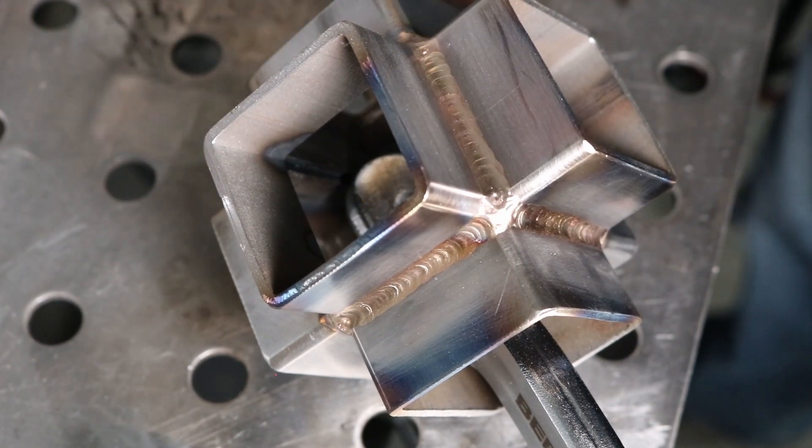Now let's go ahead and go back to the pulse settings. Here you can see it takes a few pulses to get things warmed up and melted. With this it's a similar technique — I'm just advancing forward in between each pulse, and then as it pulses, the puddle will grow out forward and I retract back a little and add that rod right into that puddle. The key is you're not trying to melt the base metal; you're just trying to heat it up, let the puddle advance forward, then get the torch out of the way while I add that filler material. As I clean it up you can see it looks pretty similar to the others — I'm getting a very similar result all the way around. The pulse helps to maintain pace and keep going, and it'll help out a little bit too if you're welding in awkward positions, letting you reposition in between each pulse.